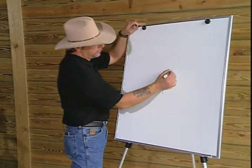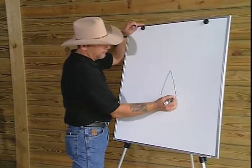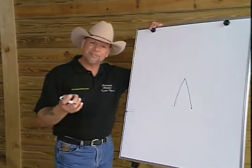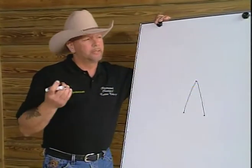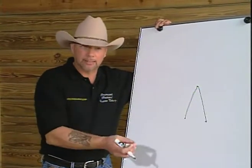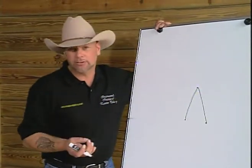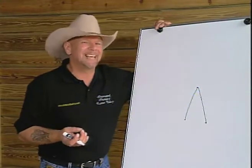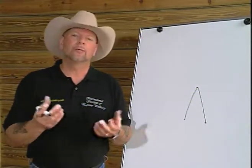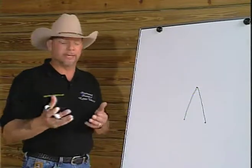If I were to have a hinge, one thing that I learned as a blacksmith was that in order to absorb shock, you have to have resistance. Take as an example a piece of string. Does a string act as a spring? Well, obviously it doesn't. There's no resistance until it reaches the end of the string, and then we have what's called a stick, which is total resistance. In a spring, we have a variable amount of resistance depending on how much force is applied to it.